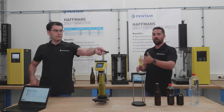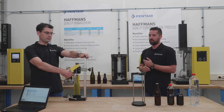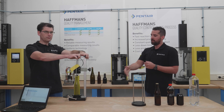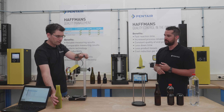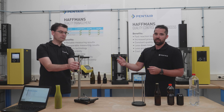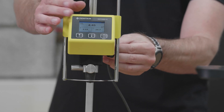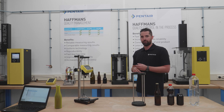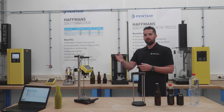Now we can take the bottle out of the ICC. First, we open the valve again so it releases the pressure of the bottle. We slide out the temperature probe and push the handle backwards so you can take out the bottle. If you want to read out the measurement you just did, it's very easy to connect it to our Navigator software with a cable. Connect that cable to the connector on the back side of the ICC and the Navigator software will automatically recognize the ICC and start downloading the measurements from the device.